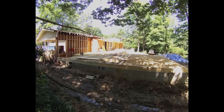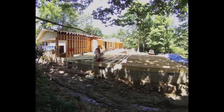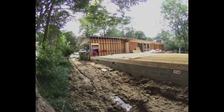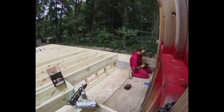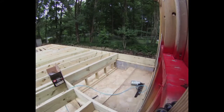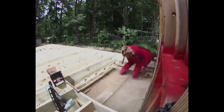It's always tough to remember where the toilet and all the drains and obstructions go. It'd be nice if I had an actual framing plan, but a lot of times on small jobs you don't get that and you just have to lay it out in the field. This was like a sunken section right here — this is gonna be where you enter off the carport and step up, I think two risers, up into kind of a mudroom drop zone. So I had to fit each one of these joists to get it right.